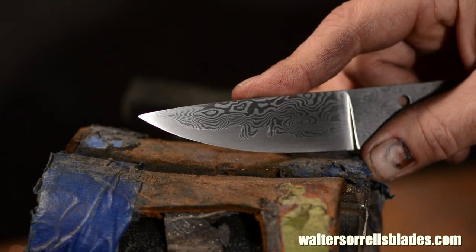I'm making sure to achieve a very clean surface with no visible scratches. One of the differences between high quality handmade knives and production knives is the time spent on fiddly little details like this. If you're just making a knife for fun though, you don't necessarily need to spend as much time as I do making these little things perfect. Once the polishing is complete, the blade has to be treated with great care. Any scratches put on the blade once the handle scales are installed are essentially impossible to remove. I won't sell a knife that's scratched even the tiniest bit, so this part is a huge pain in the neck.